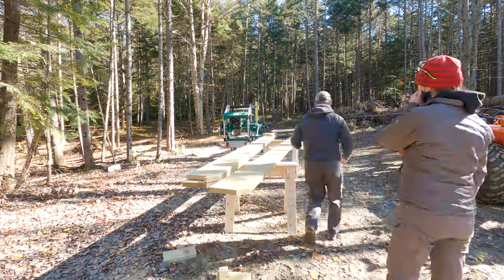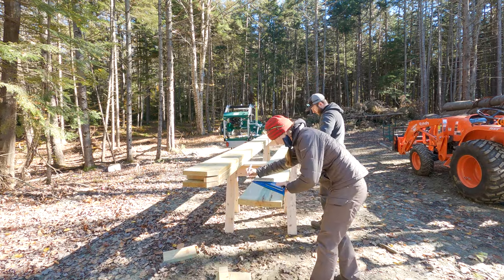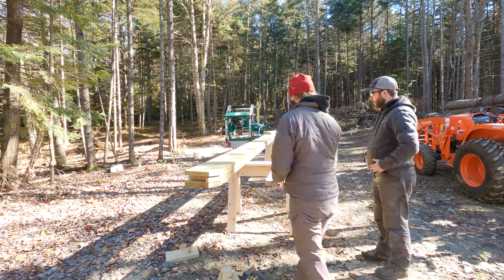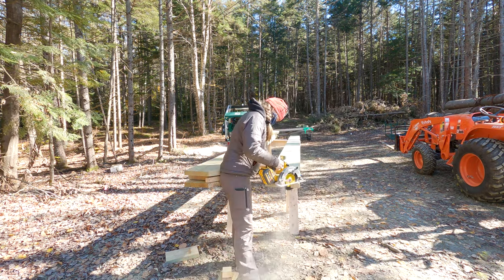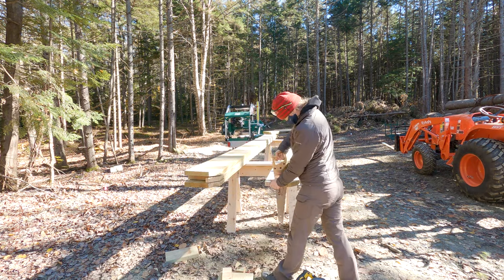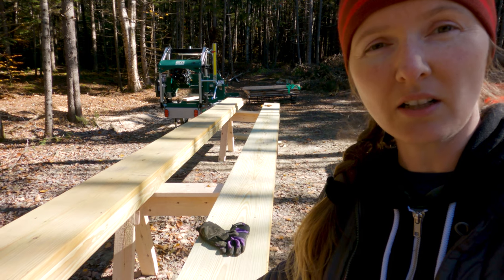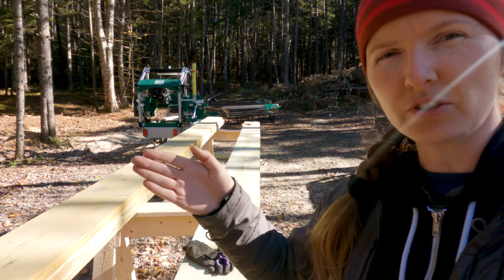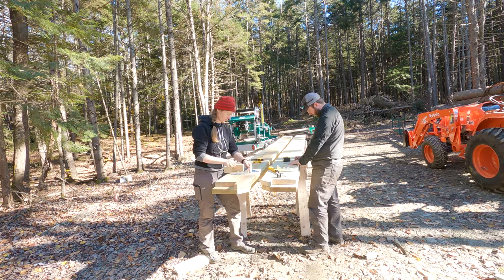We made the corner cutout just a three inch notch — that felt like a sensible number and kind of looked right. It also meant we weren't compromising the space where the 2x8 joists would fit in later. We also cut out a notch at either end of the skids where the 2x8 joists at either end would rest. The ones in the middle will be in joist hangers, but we wanted cutouts at the ends where they would sit resting on the 2x12. These 2x12s will run two on each side along the long edge, with floor joists coming in perpendicular to them in the middle.